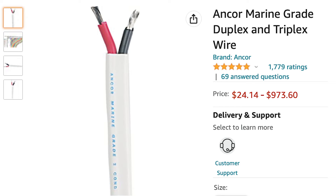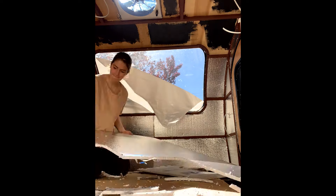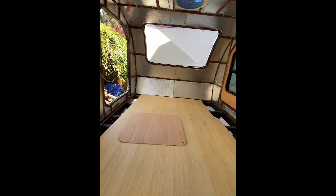Next up, we ran the electrical wires through gaps in the metal frame at the bottom of the wall, or drilled holes in the metal tubes to allow the wires to pass through. For the insulation, we used half inch styrofoam sheets that we easily cut with box knives to get each piece to fit perfectly into the space between the metal tubing. The insulation covered the walls, ceiling, and would eventually cover the floor. While doing the insulation, we made sure we cut out holes where we wanted the lights and the fan and other electrical elements to come out. The electrical system was made up of many different components, and honestly I could do a whole other video explaining more about what we did, but for now I'll just give a brief summary.